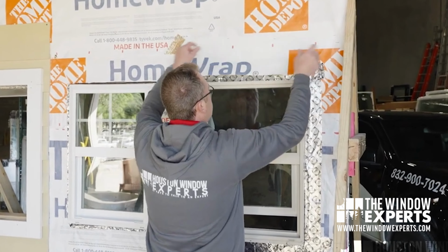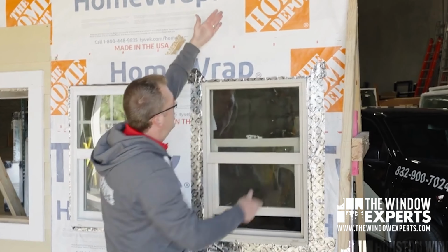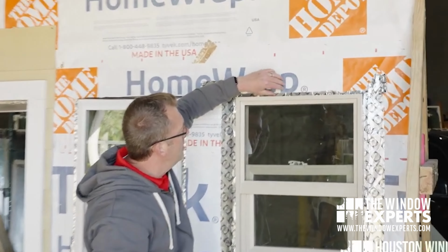You have to. You need a consistent drainage plane. It starts from the top and, like a shingle effect, it rolls downhill. You can't have a stopping point, and it can't come into the house.